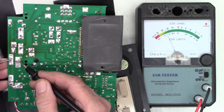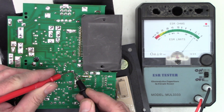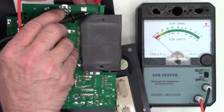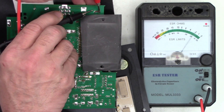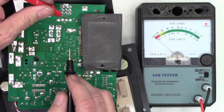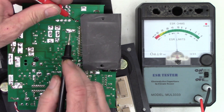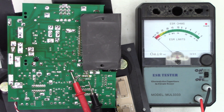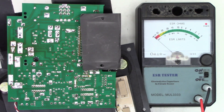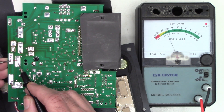Third one: one and a half ohms — still bad in my book. Now this one's kind of hard to get to without blocking the camera — I see just under half an ohm, that's where I'd like to see all of them. And now for the tens: one and a half ohms — that one's perfectly fine. And just barely over one ohm — that one is perfectly fine too. So at a minimum we need to replace all five of these 100 microfarad capacitors. Especially this one — that's 25 ohms, absolutely terrible for a 100 microfarad capacitor.